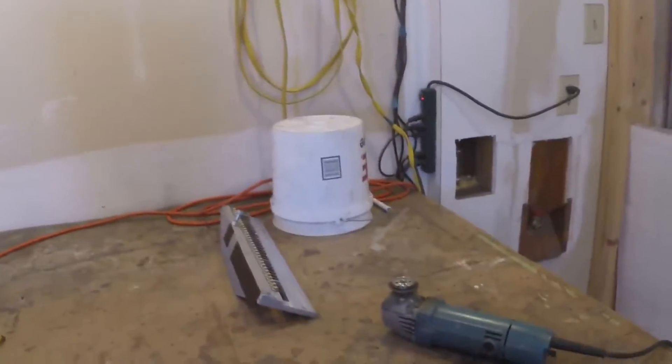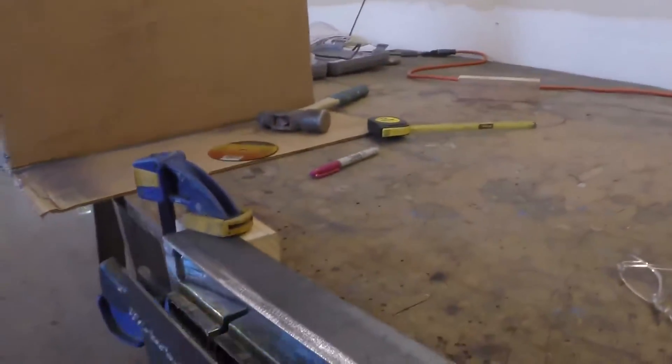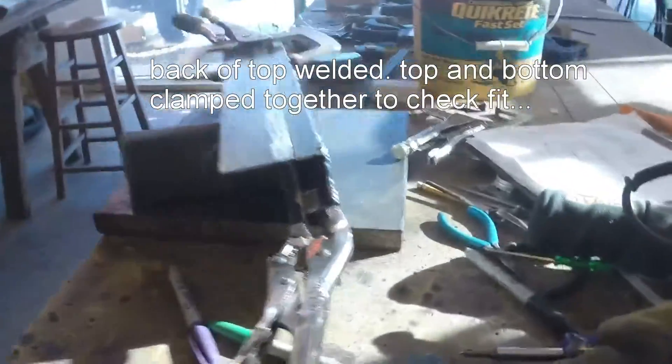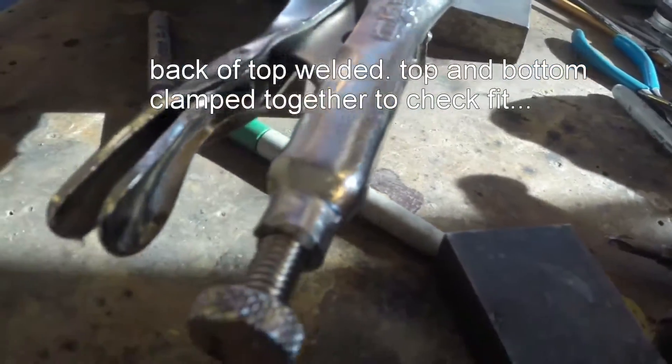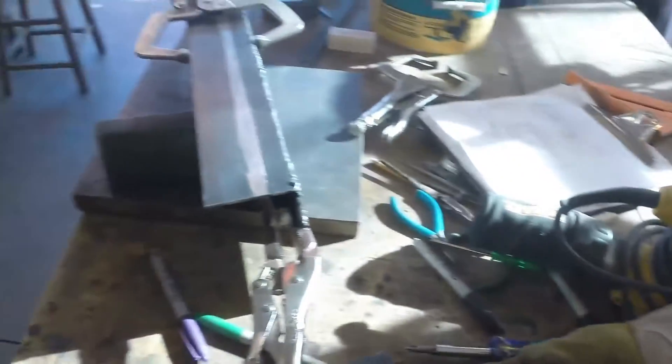This is the top, the beginning of the top of this section. This is the inside, and I've welded that seam, so when I grind it down it will be a nice line. This piece will go like so. I have to grind all of that flat and make it smooth — maybe not pretty, but smooth. I have a couple things that I need to do: I need to deal with the internal sections, these little walls around the voids. I believe they are a little high — I have to make sure those are leveled out, but not too low, and make sure there's not too much of a bow to it.